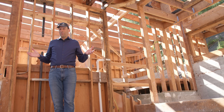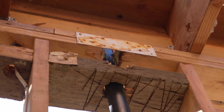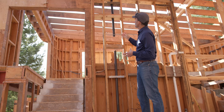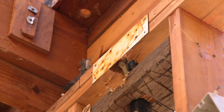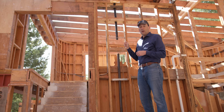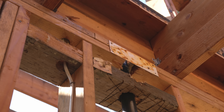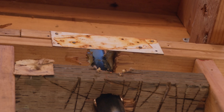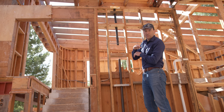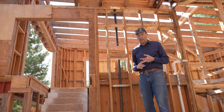We're at the top of that same shear wall and we see above us a white plate covering a giant hole they put into the top plate of this wall to fit a plumbing pipe. Instead of cutting a hole in the top plate correctly, they gouged a four-inch-deep channel in this lumber that's five and a half inches wide, leaving only an inch and a half of material. Instead of replacing that plate, they just covered it with a piece of metal to stop people from putting nails in there. If they were really trying to retain the structural integrity of this shear wall, that plate would be about two and a half feet wide, a lot thicker, and have about 50 times more nails. This shear wall is completely worthless — no accurate hold-down, no functional plywood, and no functional top plate.